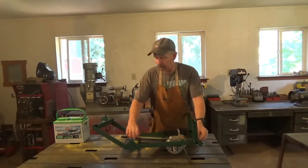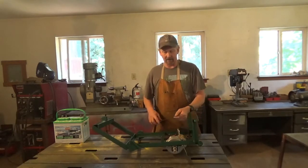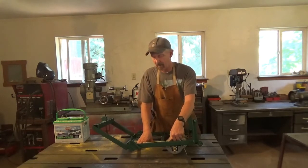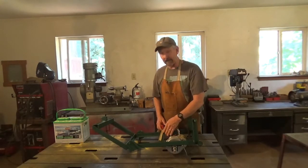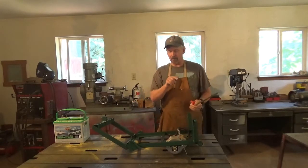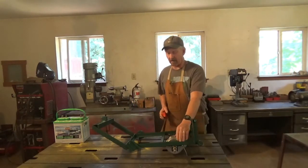The full length from front to rear is 20 inches. The full width from side to side is 17 and three-quarter inches. I'm using Group 24 batteries, so the battery tray length is 10 and a quarter inches — the batteries are 10 inches, so I left a quarter inch to spare. The width is 16 and a half inches for the transaxle, while the batteries only need 14 inches, giving me two and a half inches extra. I'll strap the batteries down to keep them in the middle of the tray. If you want bigger batteries, measure them and extend the tray accordingly.